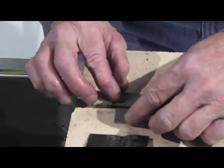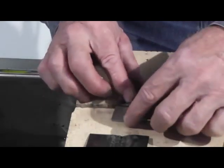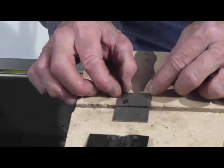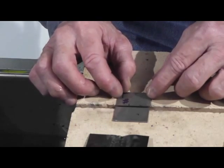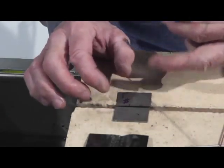Now if you're doing stainless steel, this is some 304 stainless. Even on stainless, I try and give myself just a little bit of a gap right here. You allow that steel to breathe just a little bit when you weld. I'm going to use a 308 stainless steel TIG rod. You can use a 316. Some of you aircraft guys welding that stainless, 347. That's all in the instructional book.